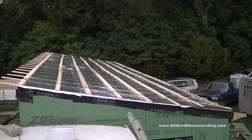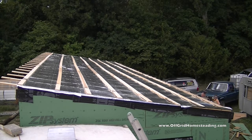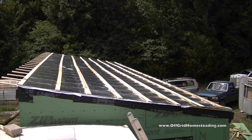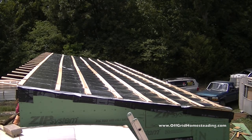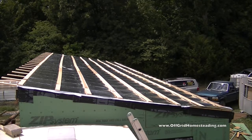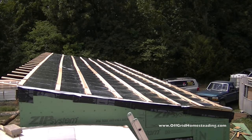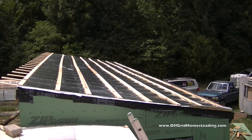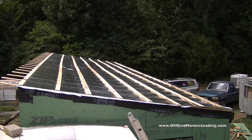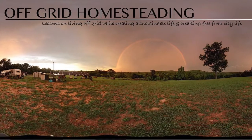With the purlins done, we've got a radiant barrier raised up off the roof so you get full emissive properties, plus an air gap beneath it — and air is one of your best insulators. Heat will travel right out through the ridge vent, and the metal roofing above will act as another radiant barrier, which should make a huge difference in keeping this space cool. I found this type of roof system referenced in research from places like South Africa and Nigeria where people are trying to keep buildings cooler from sun beating through the roof. I'll put a link to the radiant barrier — if you'd like to get some, please use the Amazon link as it helps us out. Have a great day!